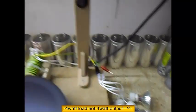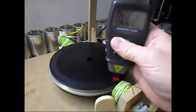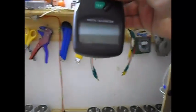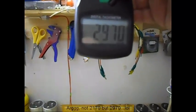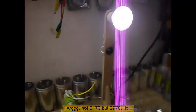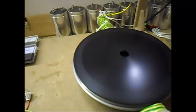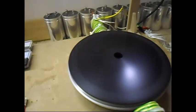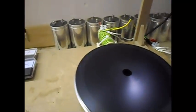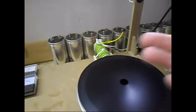I'm going to do an AC loading test. The RPM at this moment - let's check that - the RPM is now 2170. I'm running it at a far higher RPM because I need a higher frequency to get the effect. The effect is that at this RPM, this is kind of like the sweet spot.